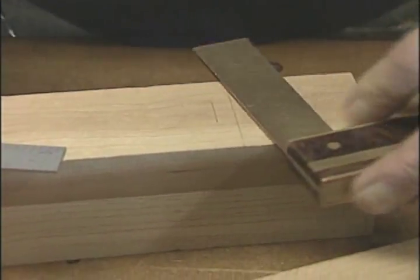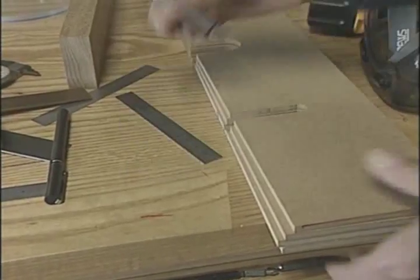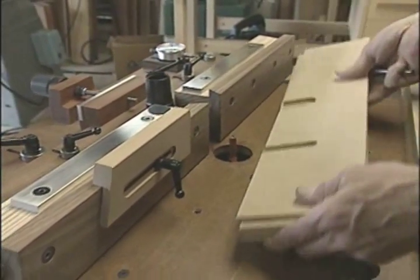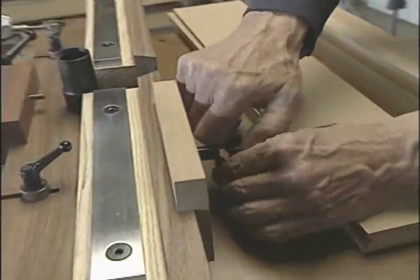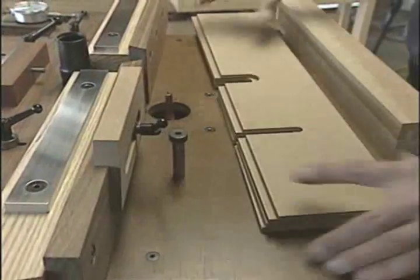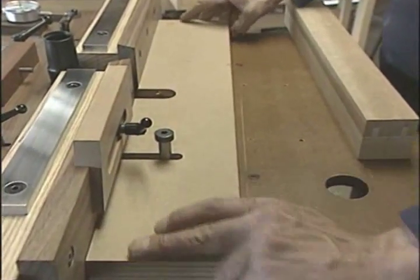The sweetest way to make the deep plow is to raise the work on a stack of lifts, removing one for each depth of cut change. I use a 3/8 shoulder bolt to trap the lifts and keep them from moving. I used to use clamps, but they always got in the way.